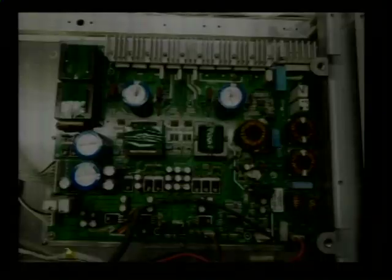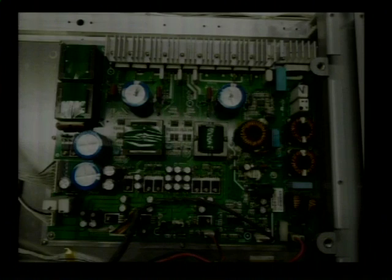You also see some transformers, those green things. Now, if you were not going to reuse that power supply, you could pull those out and measure the primary and the secondary. You can maybe step a voltage up or down to make a power supply for a Geiger counter. You can do some cool things. These chokes, those could be useful. Those blue objects, those are relays, and those are great. Well, at least the top one is. The bottom ones might be something else. Those are great for doing things like controlling big loads. Those are dumb and simple and easy to repurpose. A bunch of these other ICs in here might be house marked and might not be something you could readily reuse, but you've got a lot of stuff to work with.